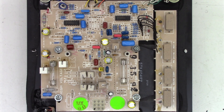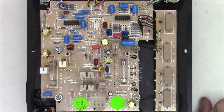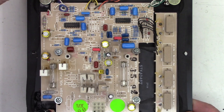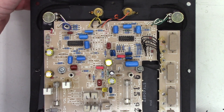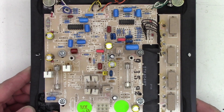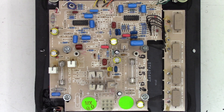Here are the internals of the unit. You can see it's got one big STK4048V power pack hybrid IC right there. Not too much to it. It's got a couple of LM358 op amps here, and up here is just the crossover frequency and bass level pots as well as the input terminals. So there's really not much that can make a low rumbling sound in a unit like this.